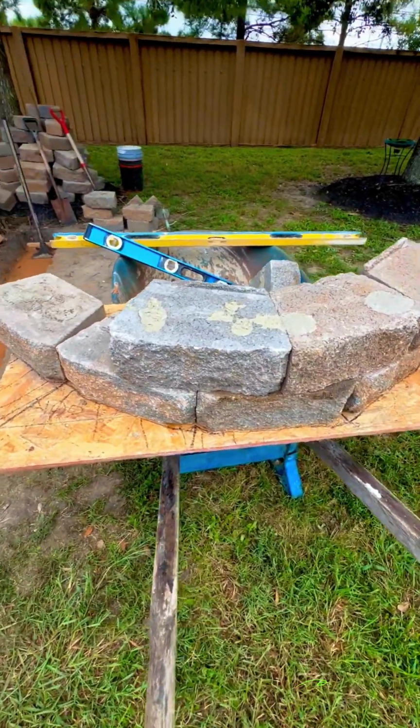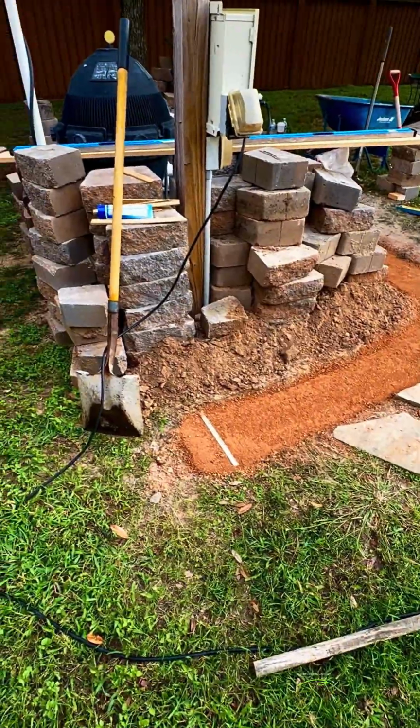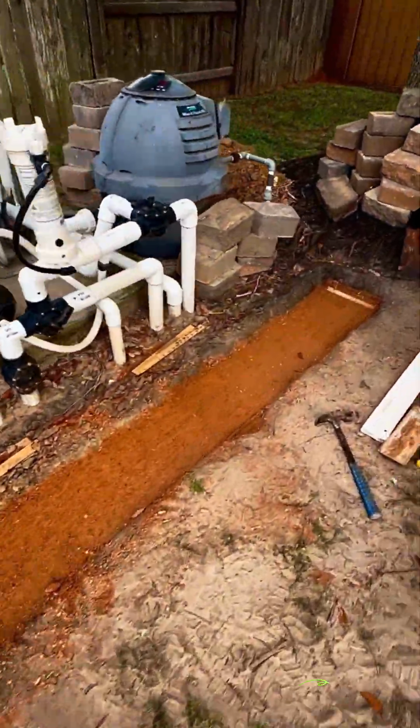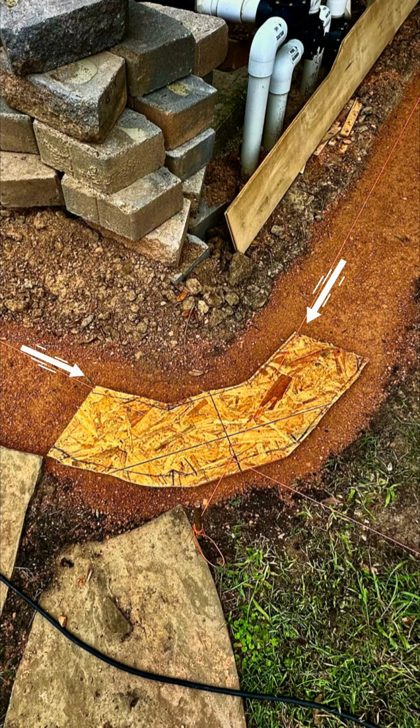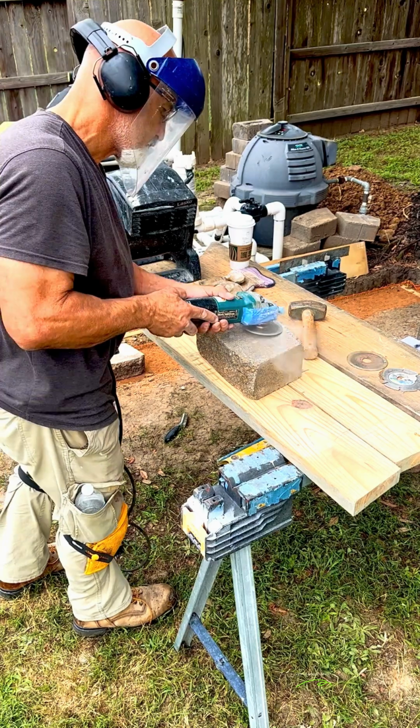I had to figure out what the corner blocks would fit like, so I made a plywood template. I placed string for the inside edge of the blocks at both walls, and then lined up the template to the outside corners of the back edge of the blocks and started installing them from the template out.